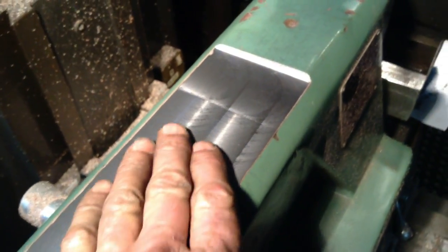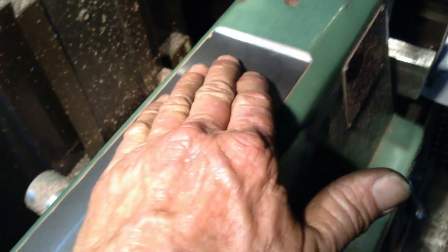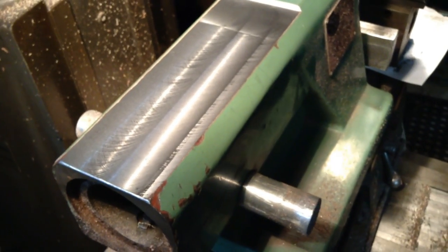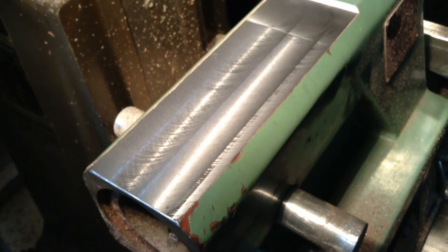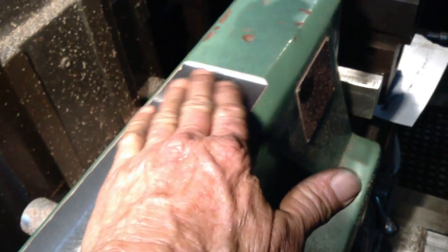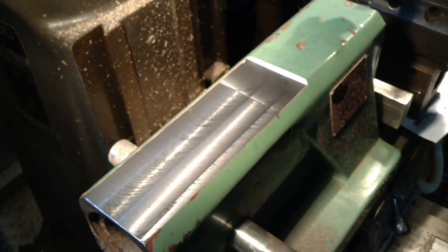The machining came out very well, considering, well, there's no bumps with the transition across the cuts. Now, this head was trammed in. I did it by eye, purely by eye, and it took 30 seconds, if that. So it has not had an indicator on it from our last job where we had the head tilted over. So there is a very quick way to do it. You don't need any special tools for a Bridgeport. I'll show you how to do it one day.